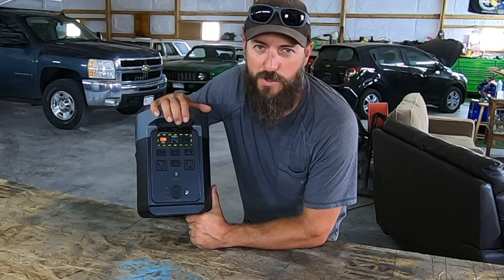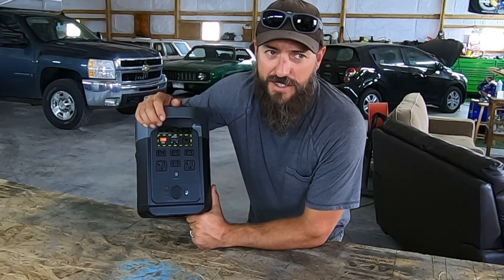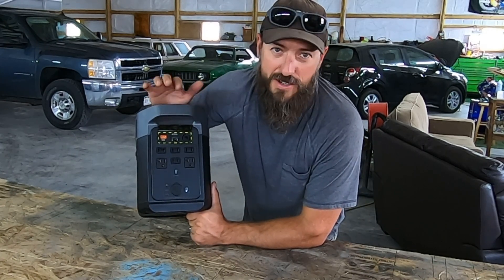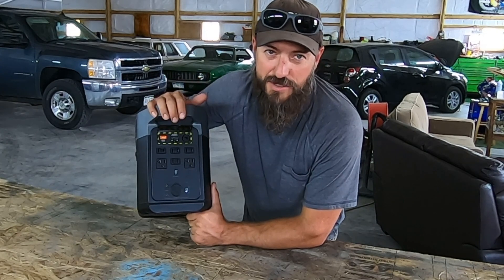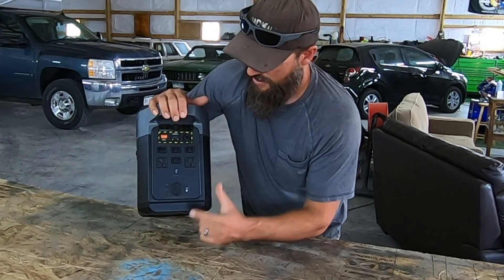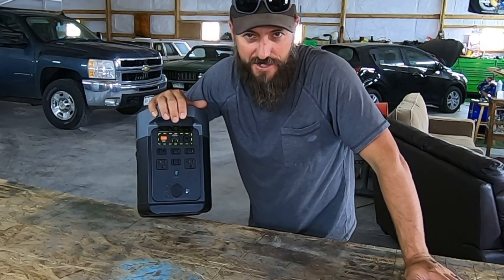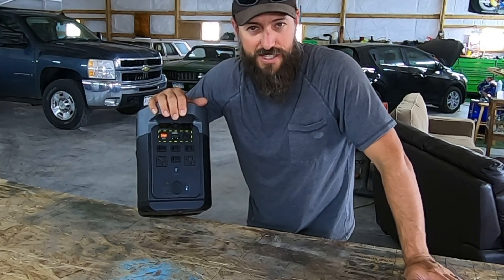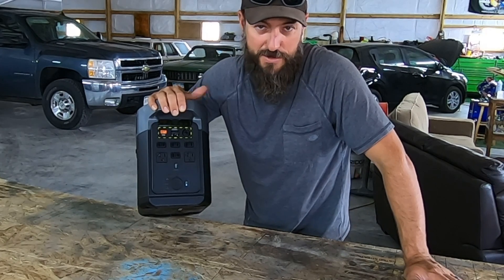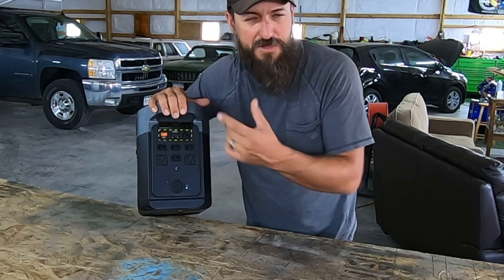Some of the old Yeti 400s has been around for what, 10 years now? Those don't fast charge — that's just a couple solar panels and you set it outside all day. If you're in a hurry or if you just want to store this thing up with a lot of energy and park it in the closet for a few months, you can. You just plug it in here to your AC outlet. This thing pulls 1,200 watts in on the charger. When it does that, the fans kick on high and it shows you exactly how much power is going in and how long it's going to take to fully charge this battery bank. Right here, that's where your solar goes in — we'll test that out too.